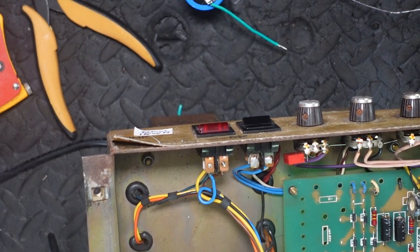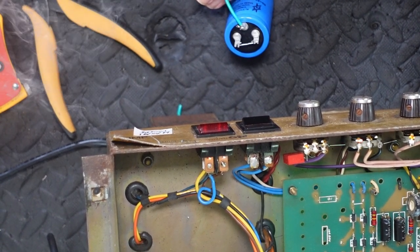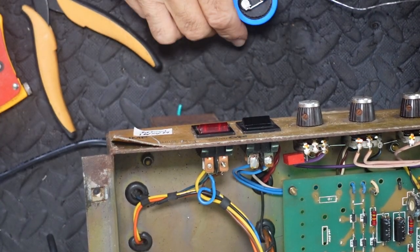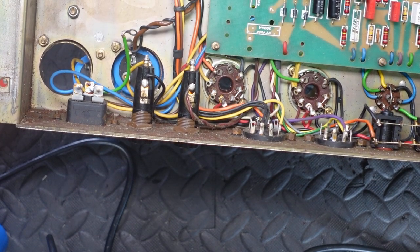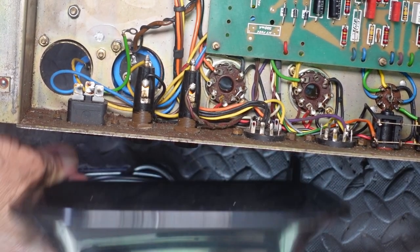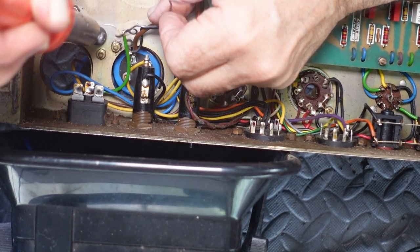Oh, should turn on my little exhaust fan. It's not so much the lead in the solder. It's the horrible acid or whatever they use in the flux. My God, that's the stuff that hits you in the lungs. My big soldering iron should be well and truly hot by now. So I just want to tin and put some solder on there. I will use that. Not as fancy as some, I know.